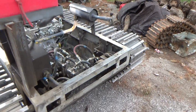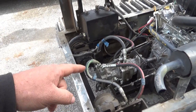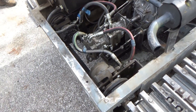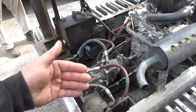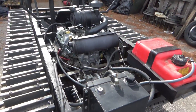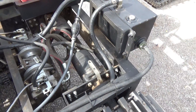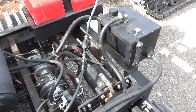So what we're testing right now is the T-unit versus the piggyback, or your tandem pumps. And then we got 21cc pumps but they're a lot smaller, and we're pushing the whole complete motor to the outside — that'll be later. The only problem right now about testing these motors is we don't know what the difference is between a 21cc piggyback and a 21cc T-unit. Right here we got the 21cc with the T-unit — you see the setup, the motors run sideways. And right here you can see how big the motors are. They're all 21cc, so it shouldn't matter that much — they would be the same. But we're going to run them side by side and find out.